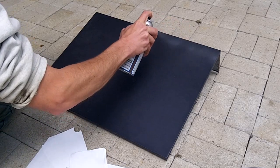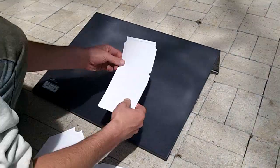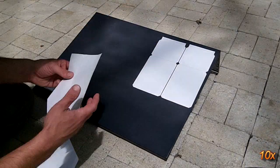The feed hopper is made from an old computer cover. I made up a cutting template for the various pieces and sprayed adhesive to the cover to hold the templates while cutting. I built in some tabs to the hopper walls so I could weld the pieces together.